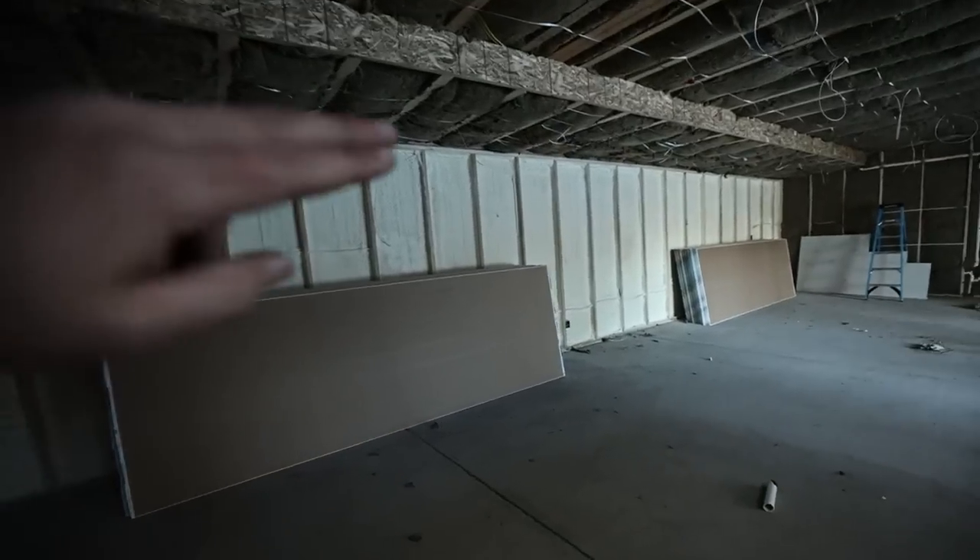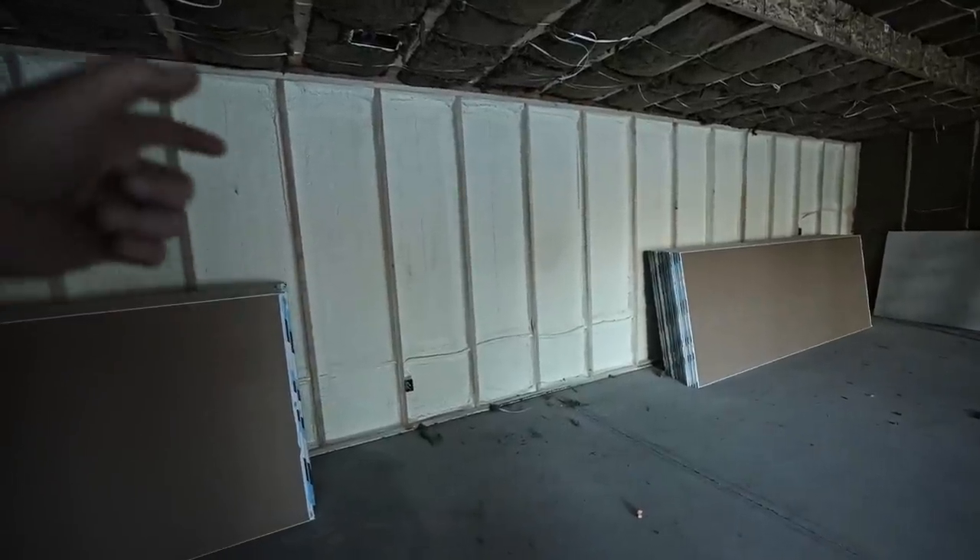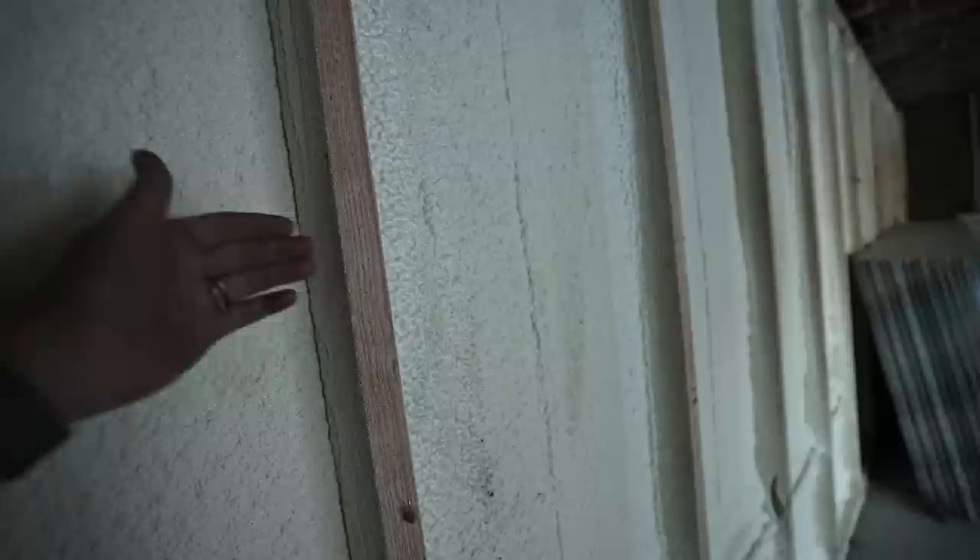The other thing is insulating between levels — if somebody's walking around upstairs or playing music, you don't want to hear all that down below. This is the back foundation wall. I did four inches of rigid exterior insulation on this foundation wall — that's almost R20 exterior insulation. Plus the two inches of spray foam here. These interior stud walls don't need any more insulation since it's all below ground. So that's like R30 or something on my foundation walls — plenty of insulation.